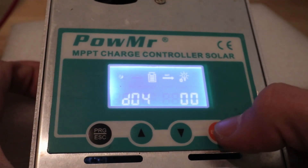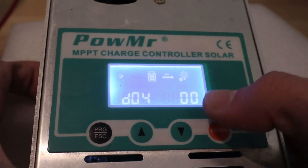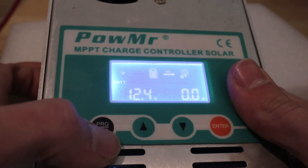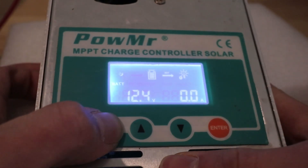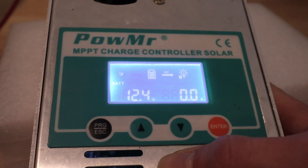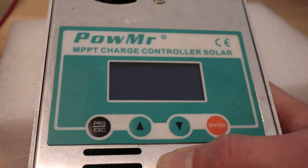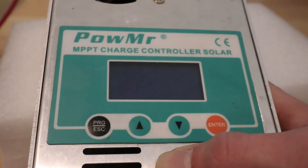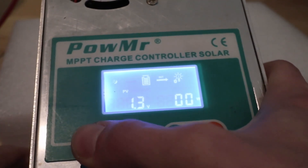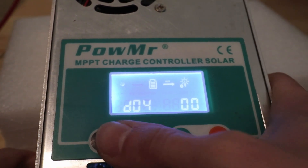Something else to mention: when you go to change a setting, once it's blinking and it's on the number that you want, you hold this enter button and wait for it to come back up. That's according to the manual how you're supposed to change the settings. Once you have all your settings inputted, I always go back to the main menu, then disconnect from the battery with your solar off — you always want to turn your solar off before disconnecting the battery from the controller. I always wait a few seconds before plugging it back in, then once it's booted up, the first thing I do is go back in and check that all the settings are where I put them.